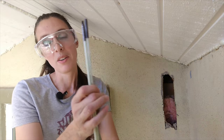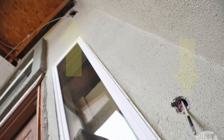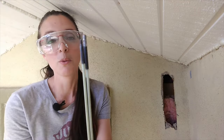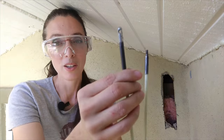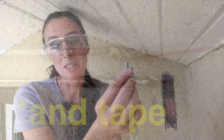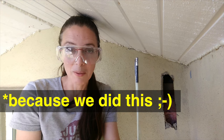If you're not able to use the flexible drill bit as your fishing line, you can use glow sticks — long flexible fiberglass sticks that you daisy chain together by screwing them in sequence. We used two of them. When running these through, make sure you have a bullet nose attachment with a hole where you can hook your electrical line and pull it back up. If you don't have it in place correctly you'll have to run it through again.